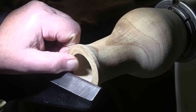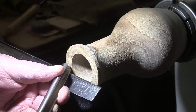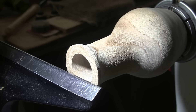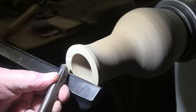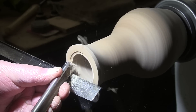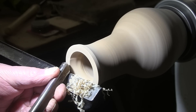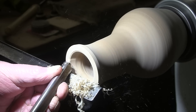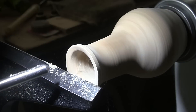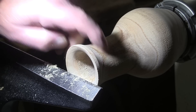I want to open the mouth up just a little bit here. I've sharpened up my half-inch bowl gouge. I need to come in here very straight and secure my gouge to the tool rest, otherwise it's going to skate on me and mess up the whole top. So I've got to be very gentle. 1300 RPM, mask and face shield on. Okay, now time for sanding.